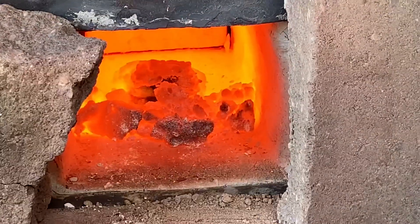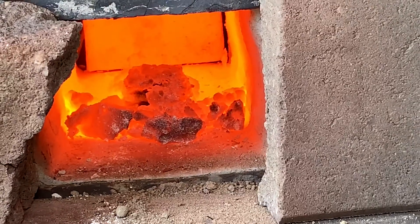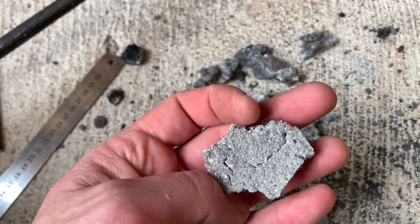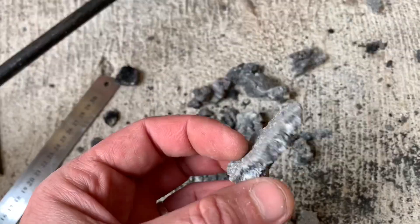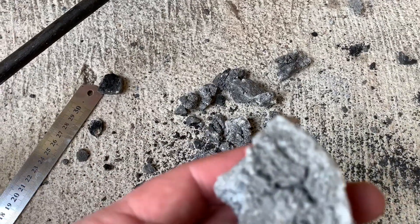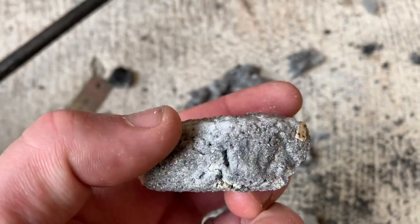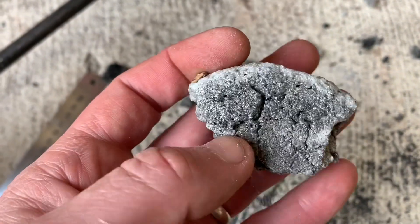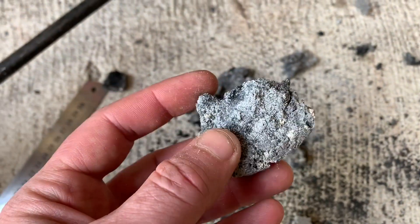Okay, the failed brick. I think it might have held together if I'd taken it out carefully and let it cool, then reheated. I kind of squeezed it as I picked it up and that's when it crumbled to bits. But it's promising, I think. It's partly the silica sand — it seems to be fusing almost into glass. I'd like to try this with some aluminium oxide, which has a higher melting point. I've seen it advertised as a sandblasting grit so it's commercially available. I just have to get my hands on some and then I'll keep on the experiments. Thank you for watching, have a nice day, and like, subscribe, and share the videos. Goodbye.